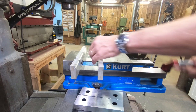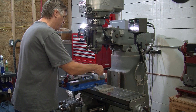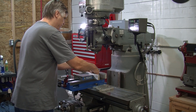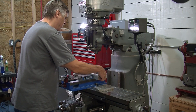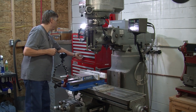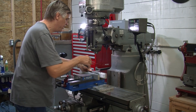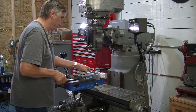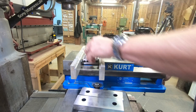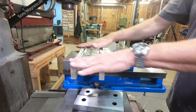These are here in the makerspace and you're welcome to make use of these. A few hints about machining soft jaws: when you machine these things, always use something to preload. On the shorter ones you can get by with a 1-2-3 block right here in the middle when machining these things, and that will ensure that this jaw is parallel with this jaw and in a good tight position so you can machine it without any chatter.